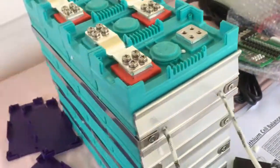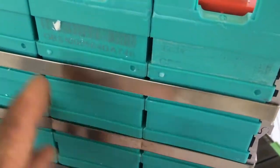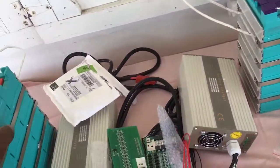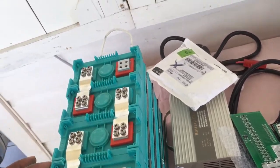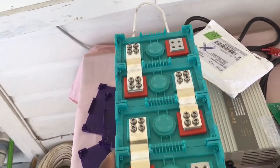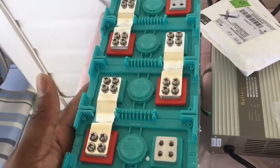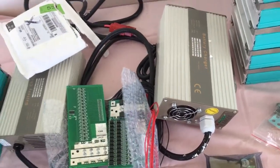They have them strapped together because they're four cells each, but you can separate them — you can order cells individually. I need at least 16 of these to build my 48-volt system, but I'll be satisfied starting out at 24. Each cell is 100 ampere-hour, and in series they remain 100 ampere-hour. I'll put two 12-volt packs in series to make the 24-volt bank, and I'll need two more packs to make my 48-volt system.